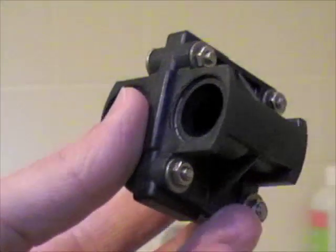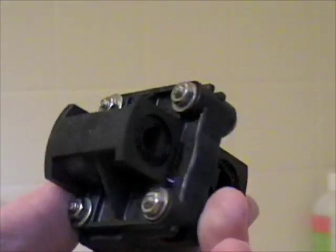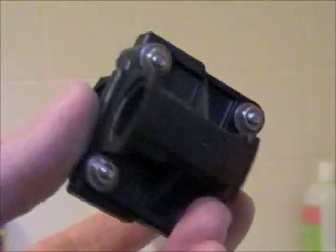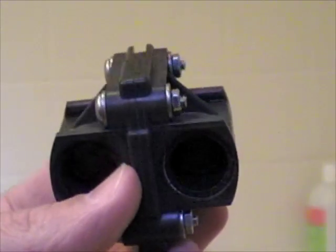We've been to the store and have a Kohler replacement part. So we're going to put everything back in with the new part. This is the balance adjuster, pressure balance adjuster, so that when somebody flushes the toilet or turns on the cold water, you don't get blasted with hot water. That should be okay. We're going to put that back in.